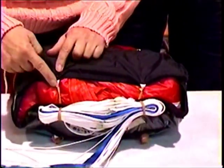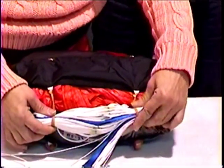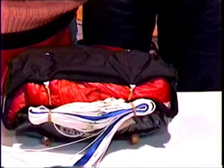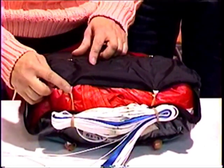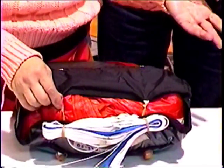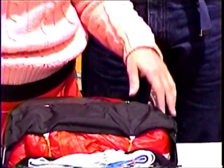Part of the reason that we put this on loosely is all these have to do is stow the lines. If you pull this tight and it's in the cold and in the heat, then it weakens this prematurely. We don't need a lot of tension. We don't need to have pre-stretch. We just need to hold the lines with it.